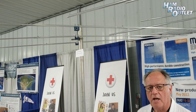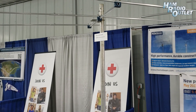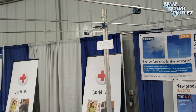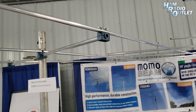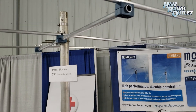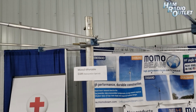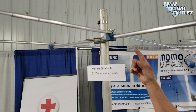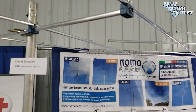We have a number of new products that we're showing here at Dayton. One is the three-element portable Yagi. It's designed for rapid deployment using stainless hardware and thumb screws and wing nuts to rapidly assemble the antenna. Very lightweight — it's under four pounds — so it's perfect for POTA-type applications and field day. It's got a beautiful pattern to it. The one pictured here is one of the earlier models. The ones you'll find at HRO will come with a UHF female connector at this junction here, so it'll be a direct feed arrangement. Very simple, very easy to get on the air.